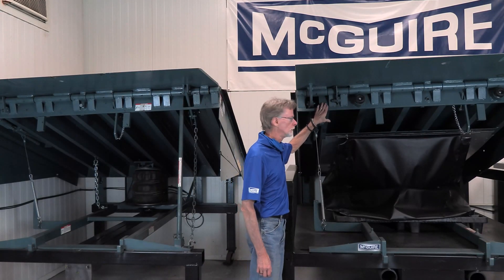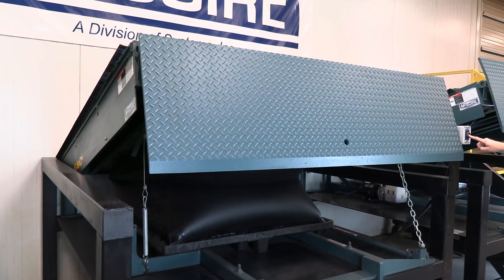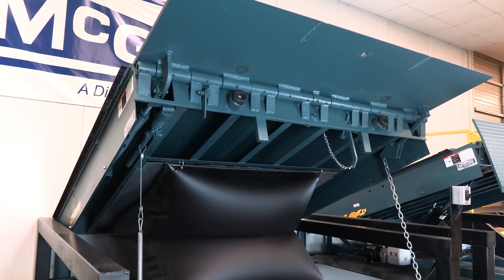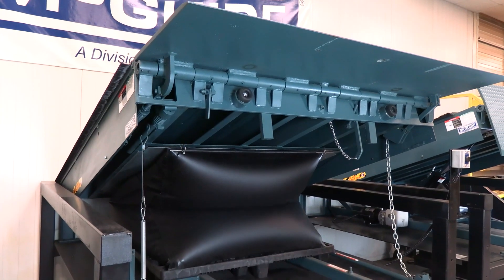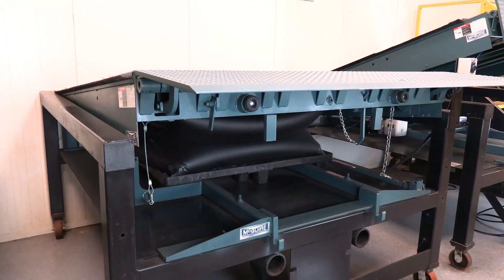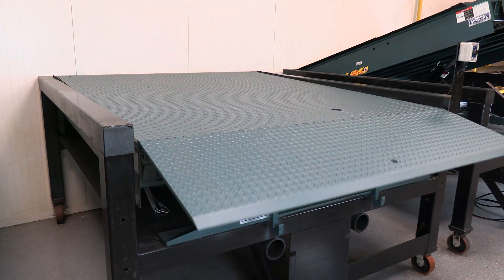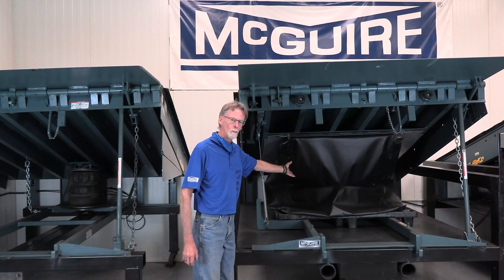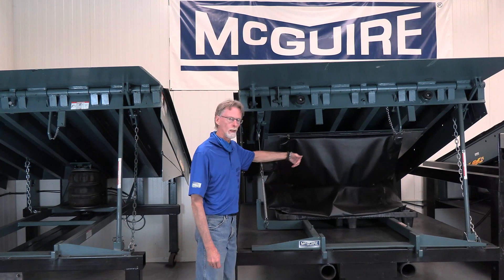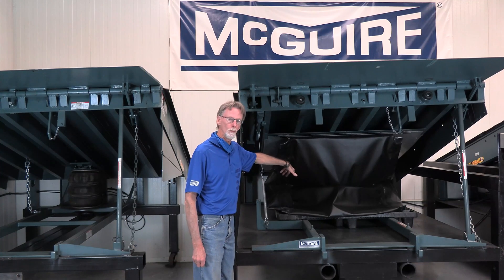Next I'd like to talk about the MA air-powered leveler. The MA air-powered leveler is powered by a power pack located in the back left corner of the pit — and a note on ordering parts: you're always standing on top of the dock looking outside, so your left is left and your right is right. Never stand in the drive looking into the pit. With that said, the blower is in the back left-hand section. The blower is rigidly mounted to the frame and is connected to the bag by a piece of flex tubing. One of the biggest things I see going wrong with that is debris getting dropped down through the frame and puncturing a hole in the tubing that connects the bag to the blower.